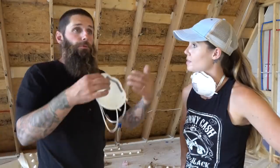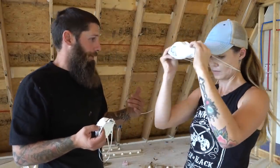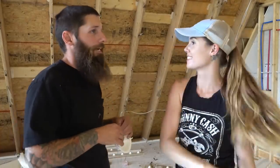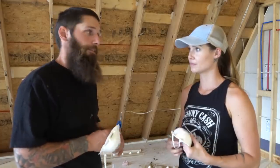Okay. Pull the roofing off, and then I'm going to get a circular saw and a 10-pound hammer that I got. He's prepared this time, guys. Got a 10-pound hammer, and we'll start bashing the OSB off the roof. All the roof sheathing, get that off. Once all that stuff's off, we start cutting and tearing it apart.